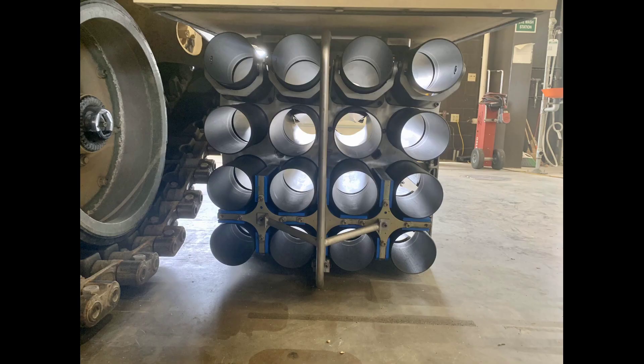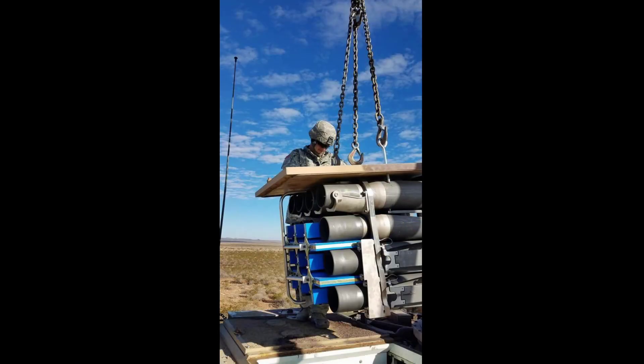Here we can also see a fourth generation ammo rack. These are interesting as they are bolted to the blow-off panels. This solution has two purposes. The first purpose is to allow for quick ammunition replenishment in the field — if a crane is available, the blow-off panels can be unbolted, taken out with the ammo racks by the crane and placed on the ground so troops can quickly replace the ammunition, then the racks are placed back inside the turret bustle and the blow-off panels bolted on. The second purpose is that in the case of an ammunition cook-off event, when the blow-off panel is blown off by the pressure of burning ammunition, in some cases it can take the burning ammo rack out of the tank, thus minimizing damage to the turret bustle.